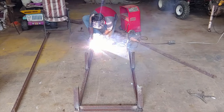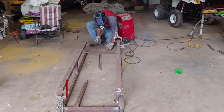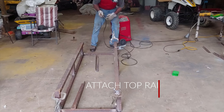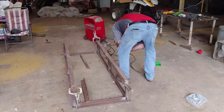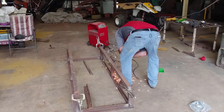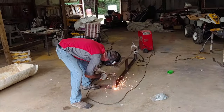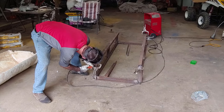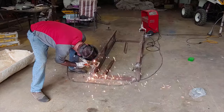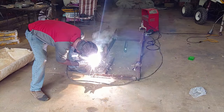We're welding those on now and we'll put a top rail on top of those uprights to frame in the drums. We're turning the angle iron out. We've got pre-drilled holes in the side where the barrel is going to make contact. Once he gets those welded up we'll set the barrel in. It makes it handy when you can do the welding and we've got a shop down at Bob's farm to do the work that we need.